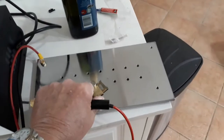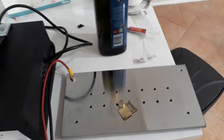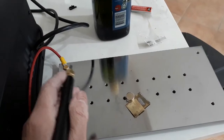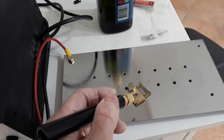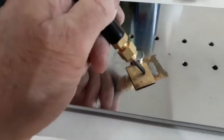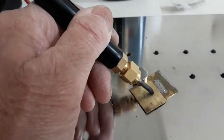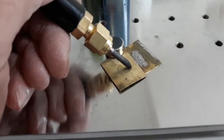I've already soldered this together — I just put some solder paste on it. This is old brass. The electric current will flow through here, through the tip which gets very hot, through the brass which melts the solder, back through the earth back to the transformer. If I turn that on and put it there, nothing comes out — not until I press the foot switch. Oh, that's too low.